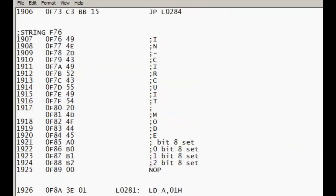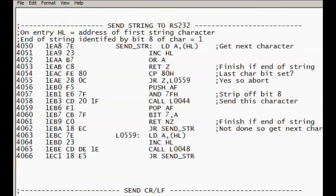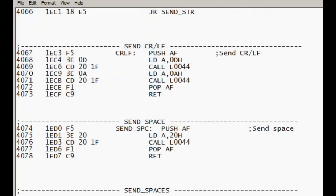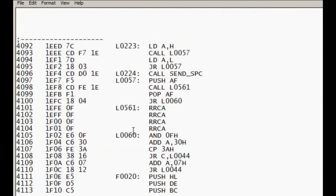That's all fairly straightforward, but where it gets very complex and convoluted is that a lot of the code, and I've done this as well when writing code with limited memory space, reuses bits of code within individual functions. For example, this function has multiple entry points depending on where it's being called from. Also, when some of these functions return, the address they return to was artificially put onto the stack. Rather than being called, the stack was loaded and then a jump was made, so it doesn't return to the point that sent the code here, but to wherever the stack address tells it to jump.